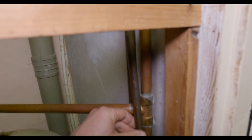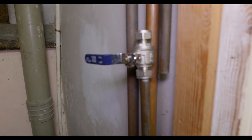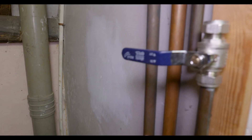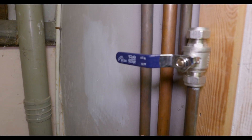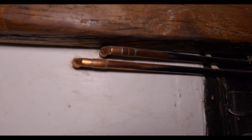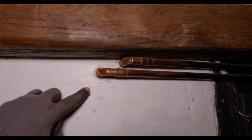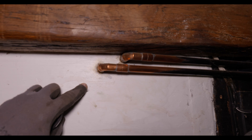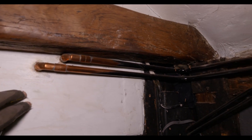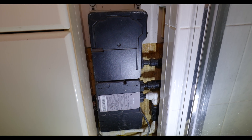The current cold water main feeding the tanks in the loft we're going to be linking over to the cold water distribution pipework from the tanks, which will then pressurize the whole house. Just to show you where we've teed in for the hot and cold supply and backfilled it behind this wall - there used to be a basin here, so in the airing cupboard we've cut the pipework and teed onto the system.